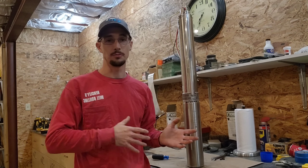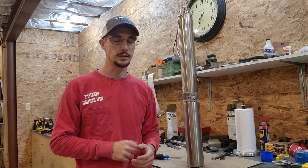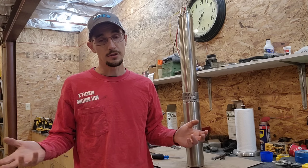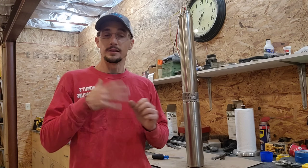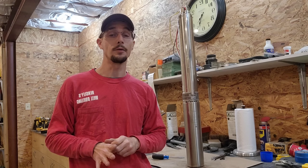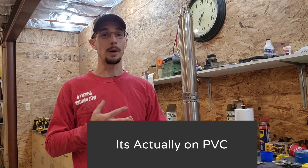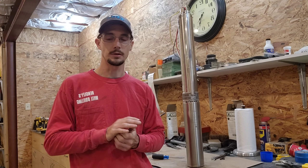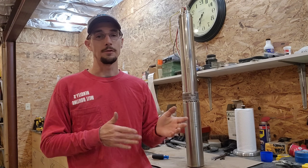This is strictly preparation before we go out to the job. We typically spend an hour to an hour and a half in the shop putting stuff together — pipe doping, threading, whatever it is — to save time on the job so the customer doesn't pay additional labor and we're not tightening things in the elements in cold weather. The next video will pick up on the job where we pull a two-horsepower, 270-foot, one-and-a-quarter-inch poly pipe using our electric pump puller. It's a commercial job so there are some regulations to follow.